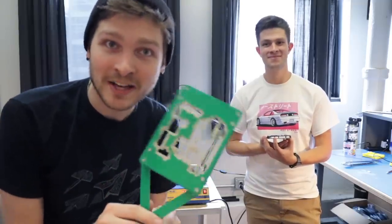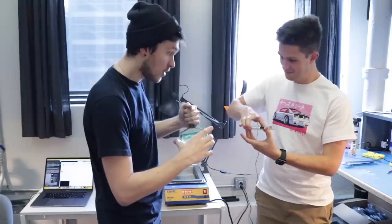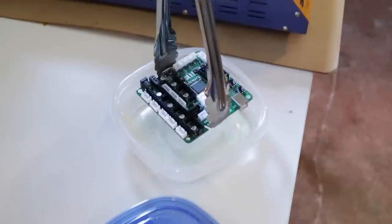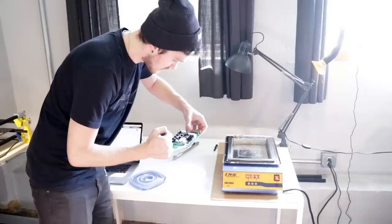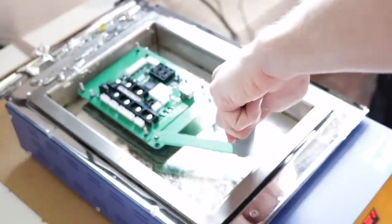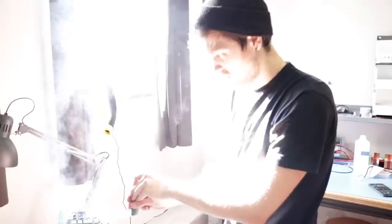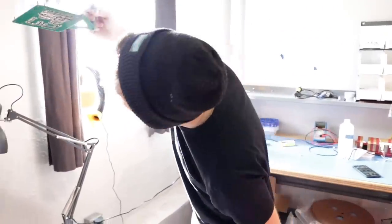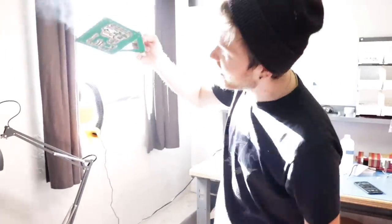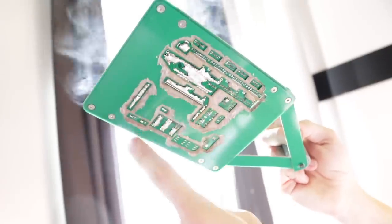I went through and sanded down all of the bottom of the pallet PCB. It looks like a mess, but now all of the surfaces come to a sharp point. Bryce has a board with all of the components populated, so we're going to drop it into this and see if we get a better solder job. We should flux it first without the pallet because it doesn't fit in the top. Bryce, what are you dipping it in? I'm dipping it in flux — Kester 959T. Now we're going to put it into the pallet. That's in there good, and now we're going to sizzle the heck out of this thing. That's better — and also a lot worse. Better in some ways, way worse in others. Some of them it totally got, and other ones there are whole batches that are completely filled up, all these pads just totally full of solder.